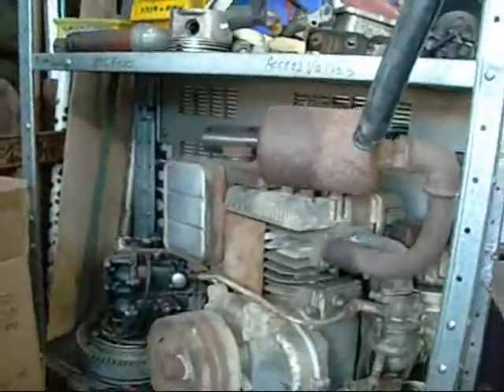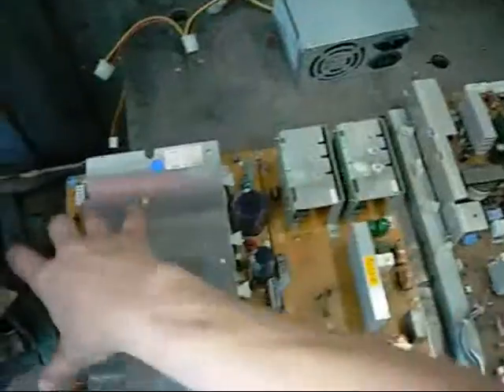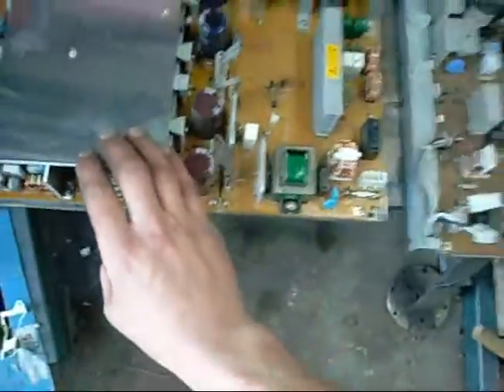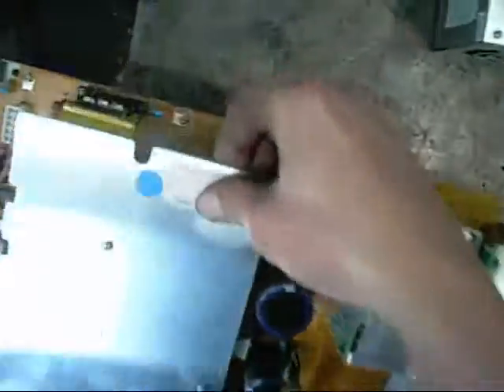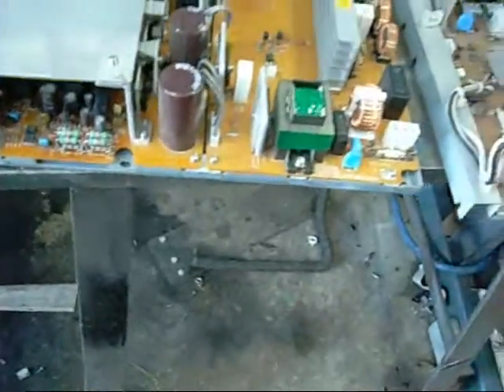I can't access the current electrolysis power supply because it's behind that shelf and has an access cover on it — thankfully I don't blow them up often enough to have to worry about moving it. I do have a grid with fans attached over the top of it, but this is identical to what I'm using at the moment. It's come out of another DI620 Minolta photocopier — multi voltage switch mode supply. This one here is just a spare I keep in the cupboard just in case, because I know that one will blow up one day.